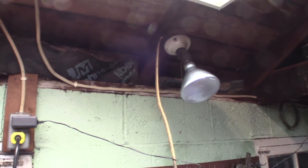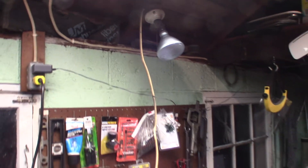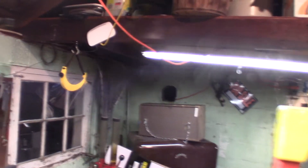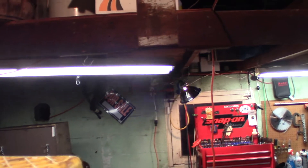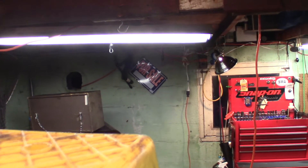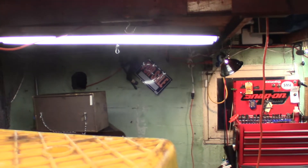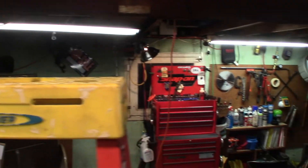This little light is going to be off of it as well, and that little light has got its own little built-in switch — a little pull cord. I'm going to rewire this junction box right here, so that plug above my toolbox back there will be on its own dedicated 20 amp breaker. That's also where my shed comes off of, and I've got most of my lights running off of that — so that will be 20 amp running on 12 gauge.